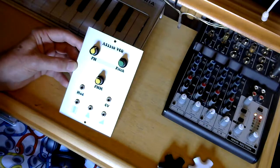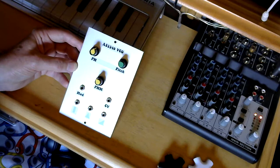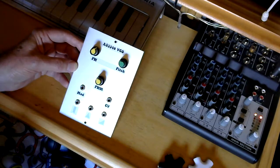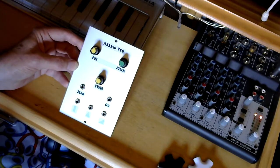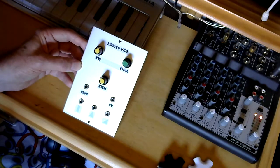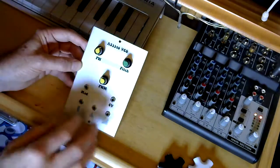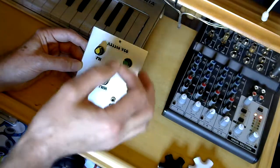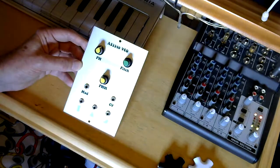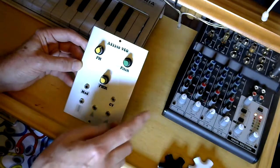When I make the next video in this series, I'll be looking at the other VCOs in Project 12, and I'll talk a little bit more about working with linear VCOs that don't follow that standard. But anyway, digressing. This one is a 1 volt per octave. So when you're tuning with the pitch, what you really want to be doing is setting the coarse tune. We'll have a look at what the other tuning controls are when we flip the board over.